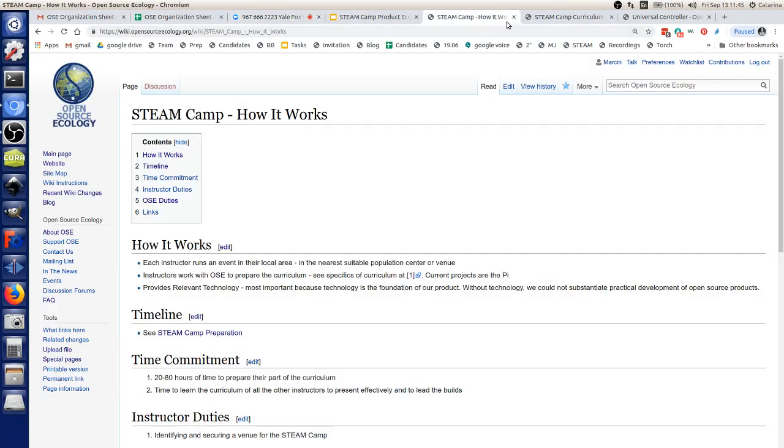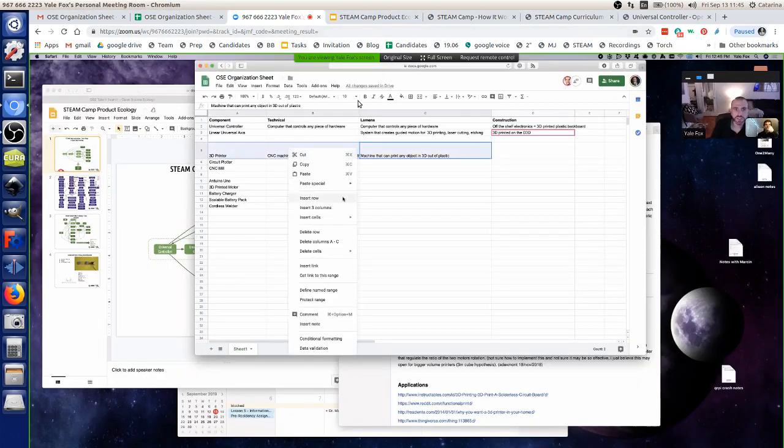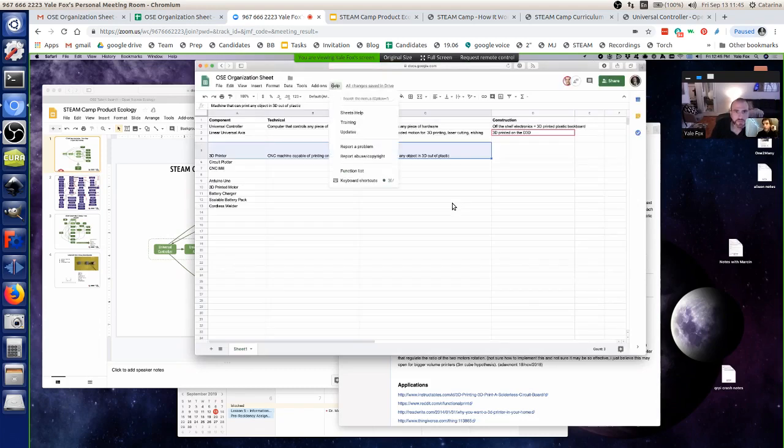And so what do you use to make this? So how did you make the 3D printer? We designed it and we printed it on another 3D printer. Okay. You use a metal frame, so it's got a universal frame like the metal frames we make. Then you 3D print the universal axis and you build the controller on it. Typically you buy the extruder off the shelf. In this case, we're going to build our own. It's a simple extruder.